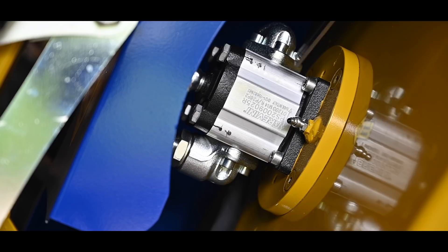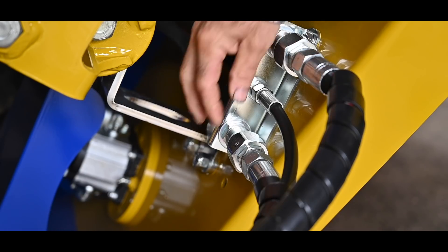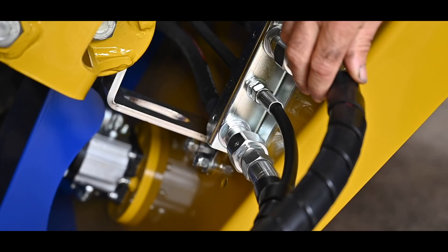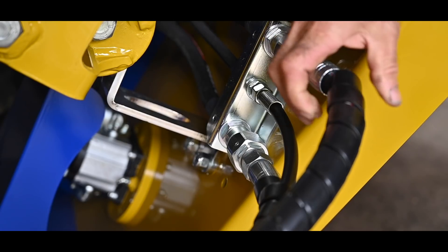The blades are driven by a hydraulic motor — one motor for each blade. There is a greasing nipple in the front, and it's recommended to grease the spindle every time you use it to extend the life of the bearings. These are very high quality motors, and you can see that on the connectors, the brand, and the cables. The connections of the hydraulic system to the mowing deck are very solid and detachable on these big lugs, and the hydraulic hoses are of great quality from a well-known brand called 4stream, even protected with a plastic shield.